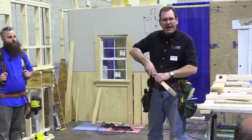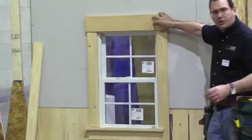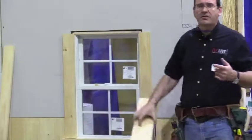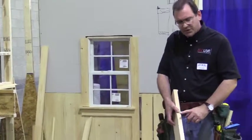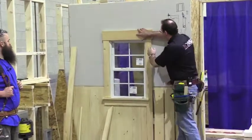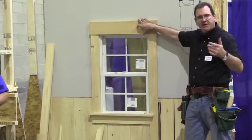We've got a piece of five-quarter and maybe three-quarter here, so we've got about a quarter-inch shoulder. What I tend to do is study historic details. In craftsman style casing, this would be a quarter-inch projection beyond the plane of the face of the casing. It was rarely just a quarter-inch projection beyond the end of the casing — it was almost always a half-inch to an inch projection on the ends.